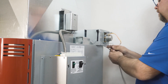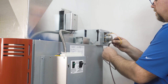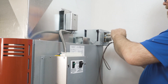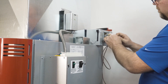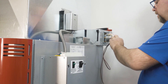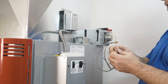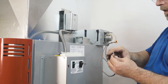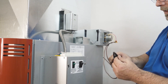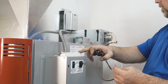On these two wires here, place the wire completely in and make that connection nicely. We'll continue this on to the main control, and as per the manual, we're going to want to place this in the 10 and 11 spot on the main control up top.